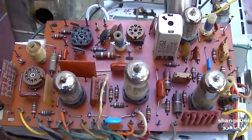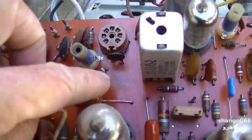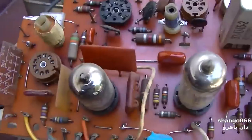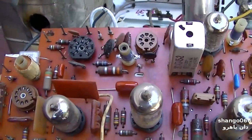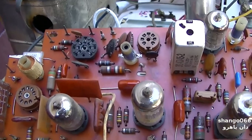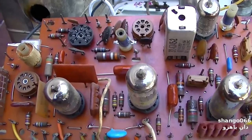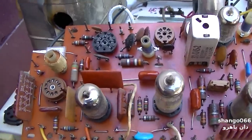This is going to be a tedious process, that's for sure. Thing is, you have to solder all these ground tabs back too, because they ground different parts of the board, and unless all of them are soldered, then you're not going to have certain circuits grounded appropriately. So yeah, big pain in the ass.